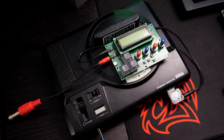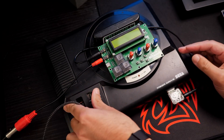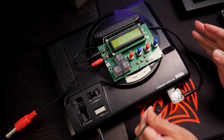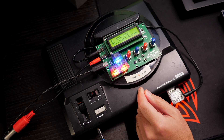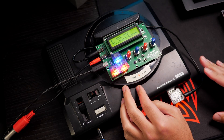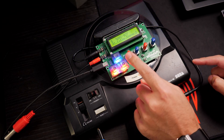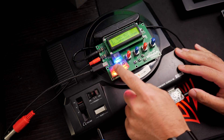Then we can boot everything up. The order in which you boot stuff up is important. When you turn on GenMDM, you'll hear the Mega Drive booting and you'll hear the noise — that means GenMDM is running, active, and has access to the sound chip. Then if you turn on GenaJam after that noise, you'll hear the tone change slightly. That means GenaJam has now sent MIDI CC messages to GenMDM. Changing patches will send 300 MIDI CC messages across to GenMDM, replacing all the settings on all six channels all at once.